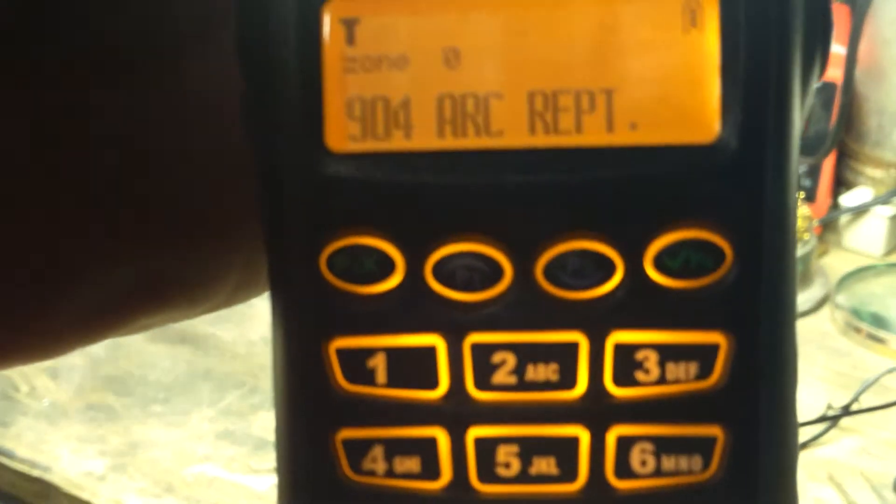The scan feature works on any frequency. This radio also has weather programmed in, and it'll go on the ham band no problem. It's set to my local ham radio club's repeater in the middle of the county. This also does two-tone sequential decoding — I think it'll do five and six tone as well, which is a European format, but we just have it set up for two-tone.